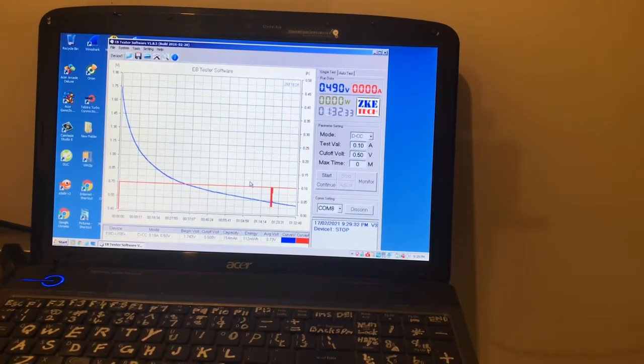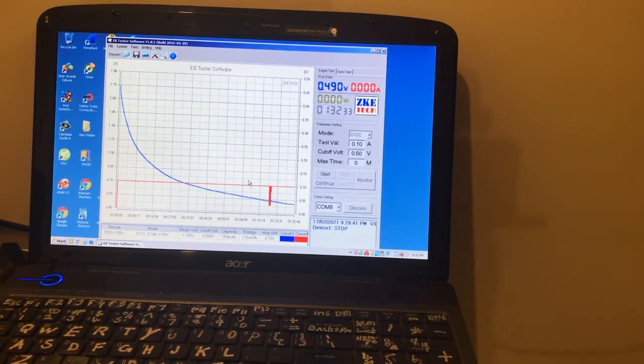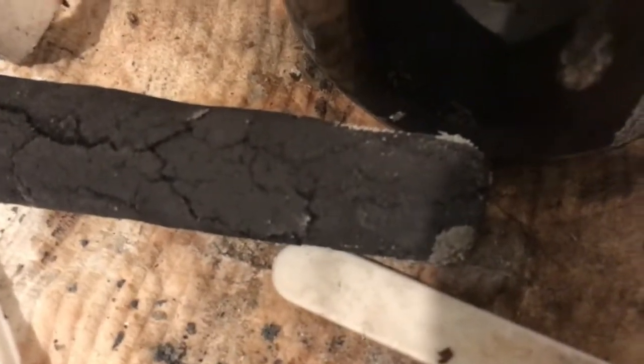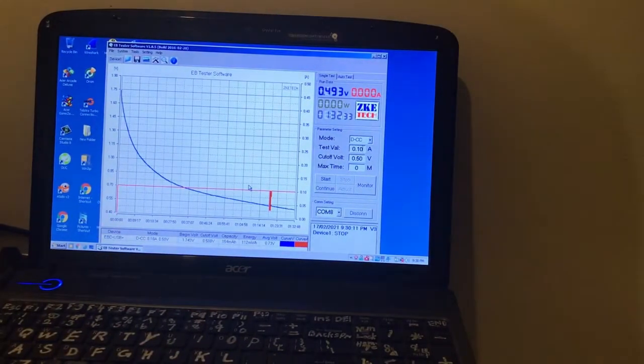Back with the copper rod negative plate. Slightly down on the energy than the carbon one, and a bit higher on the capacity, but it's not completely drained for some reason. Plus the carbon version strips the zinc right off it. This one, not so much. I wonder what happened. Wonder why that's the case.